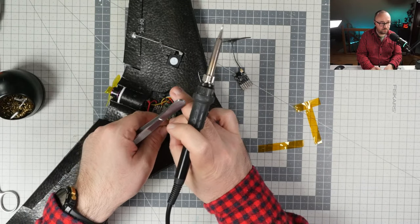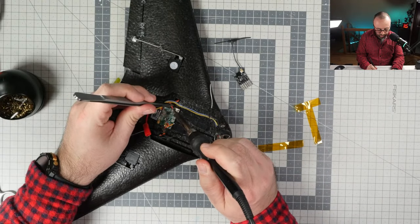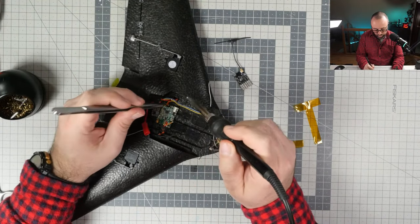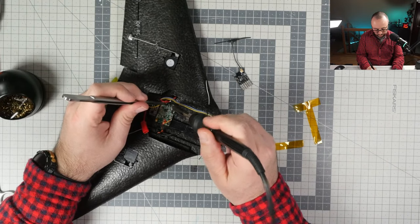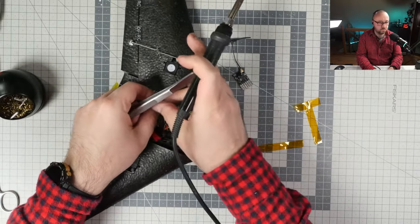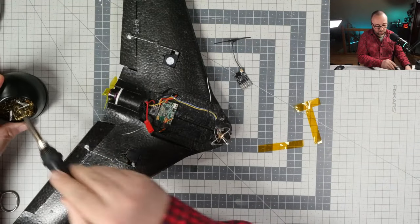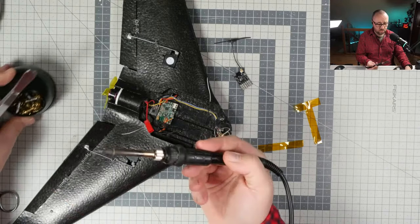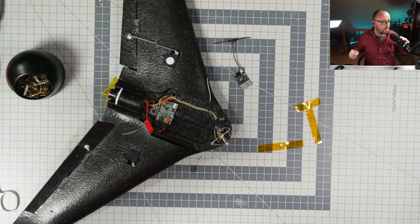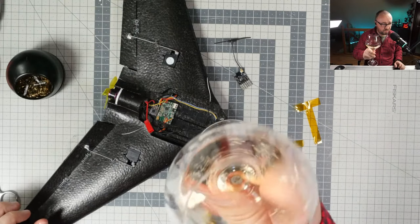But the FPV setup and the receiver are powered. Oh no, here we are. Lovely. Are powered from the BEC, and it's working quite fine. The modern BECs, especially the good quality step downs. I'm almost exclusively using those little step downs from Matek. They have enough of the max current to allow you to connect anything you want and to be able to power this thing. Absolutely not a problem.